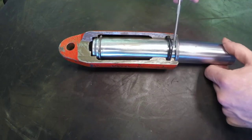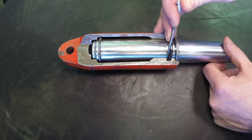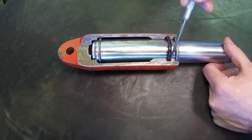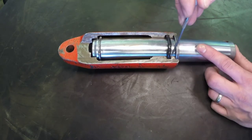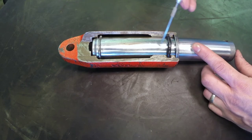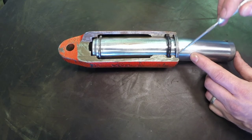This seal right here is the o-ring seal, and sometimes you'll see them with an o-ring seal and a plastic backing ring. That backing ring would be on this side to prevent the o-ring from being pushed past this small groove here — high-pressure oil has an amazing way of just slicing apart o-rings.